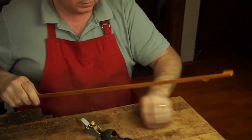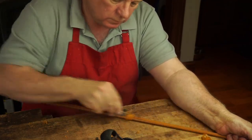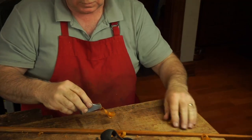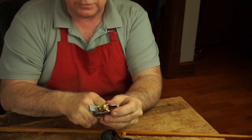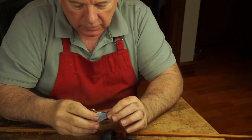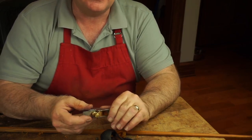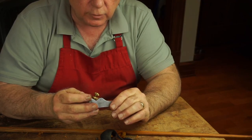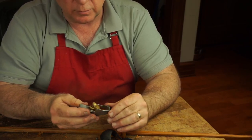Sheila asked, are these plane blades at about 35 degrees or something steeper? For the little one and the 9.5. Yeah, this one, the blade combination, so it's 25 degrees for the blade angle, and then the grind angle is probably about 35 degrees, so together they're about, what would that make them? You expect me to do math? Yeah, I'm expecting you to do math here.